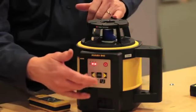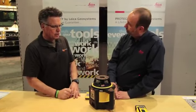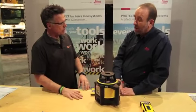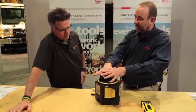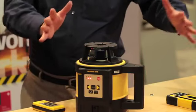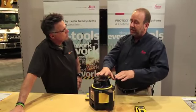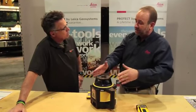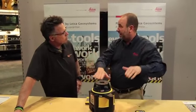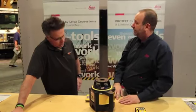Anything else you want to do from that? You've got a simple keypad here and your full function remote. A lot of rotating lasers will sound an alarm and you've got to go back and reset it — this one just automatically does it for itself. The self-leveling feature gives you a full 10 degrees of range to level in its first instance. Then it sits there for 30 seconds, and if nobody has disturbed it, it goes into what's called an elevation alert mode. That elevation alert still allows self-leveling, but if somebody kicks the tripod a little bit and it were to sink and re-level, you may be at a different elevation — you don't want that. So it'll shut itself off and start beeping, telling you to come back, set it back up, and make sure your benchmark is correct.